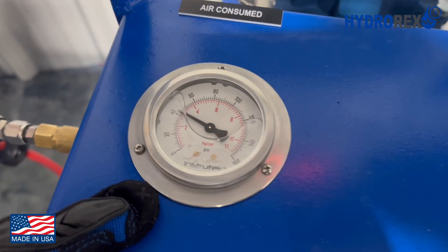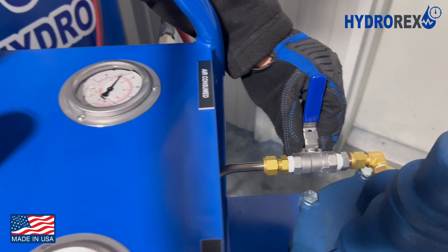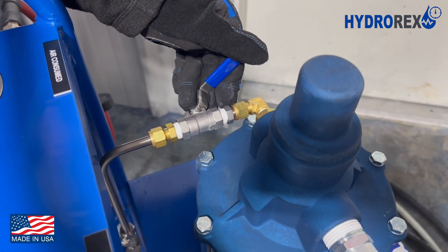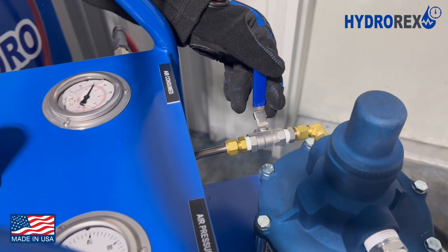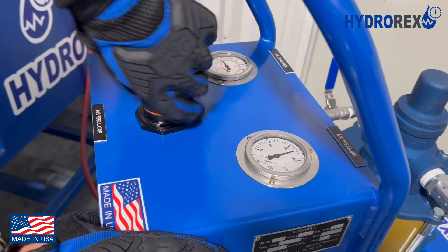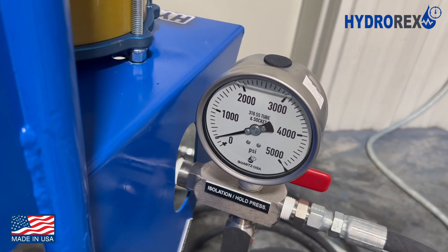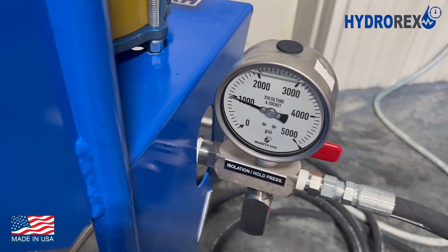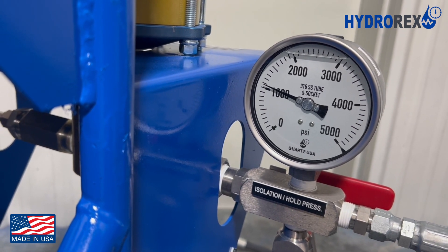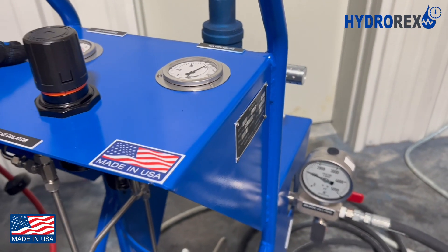This is the regulated air pressure used by the quick fill pump. To begin pressurizing, you have two options. Option one: lock your air regulator and control by opening your air valve slowly. Once you reach desired pressure, close the air valve. Option two is to back out your air regulator and start over to have precise control. We have stopped at 1,000 PSI to inspect for any physical leaks. Once we are finished inspecting for leaks, we can continue to pressurize to desired pressure. We have found zero leaks in the system, so now we will continue to pressurize to 2,000 PSI.